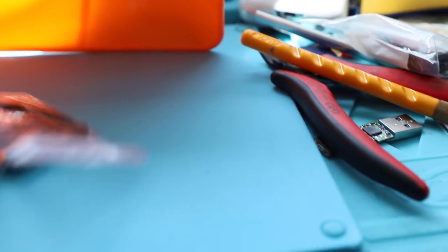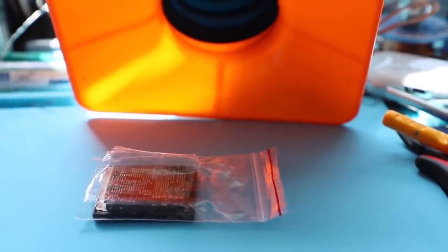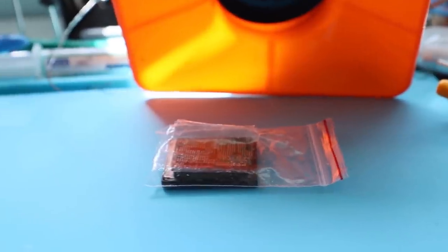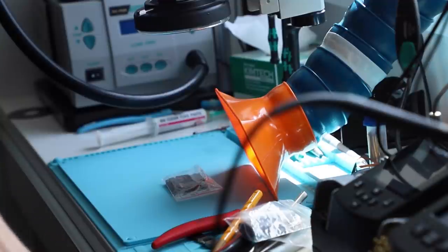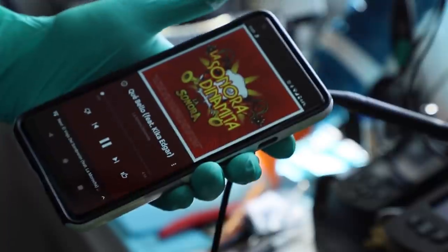Now, this won't solve every single issue with the CF card made by Lexar, but often enough, we do see devices that come in with either connection problems on the controller or connection problems on the memory component. So by following this procedure, most of the time these cases do get solved. If they don't get solved this way, we recover data directly from memory chips through the chip off recovery procedure. So let's begin.